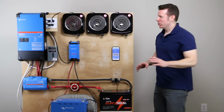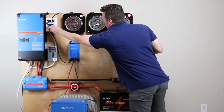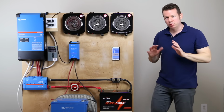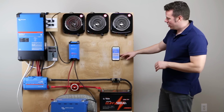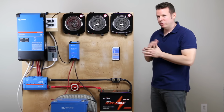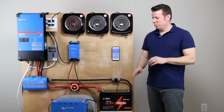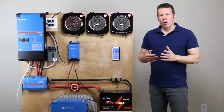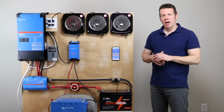All right, it's getting a little bit toasty in here. What I'm going to do is plug the charger in all the way, and it should turn on, and it's already set up to pull about a certain amount of amps. Let's see. So actually I kind of overshot it a little bit. It's at 114-ish amps. And this is supposed to put out 100 amps continuous. So we are overdoing it, and I'm just going to see how long the battery lasts.